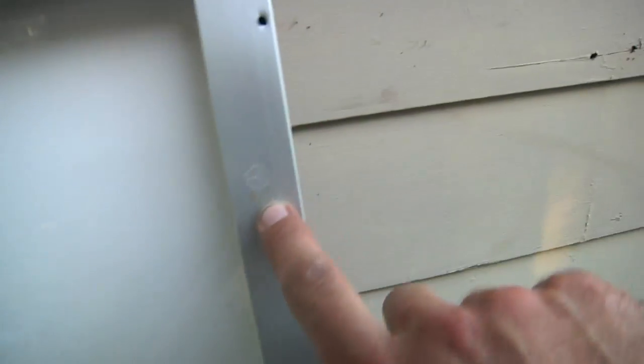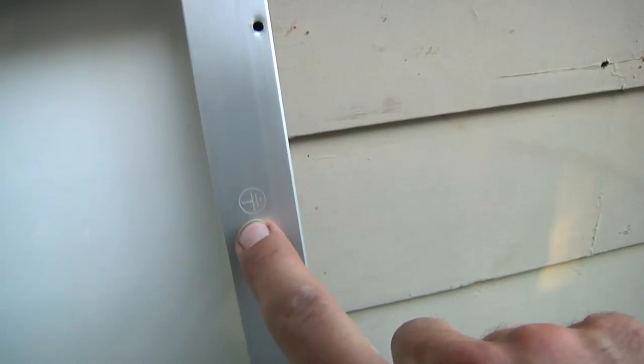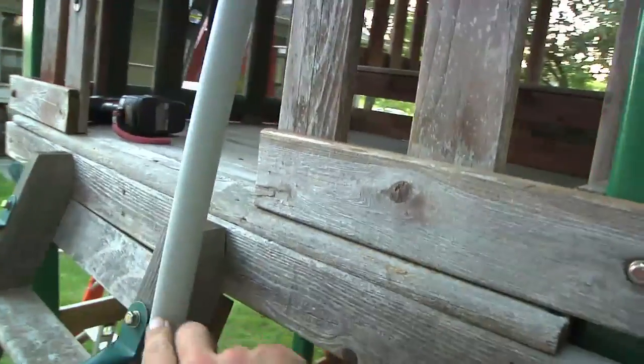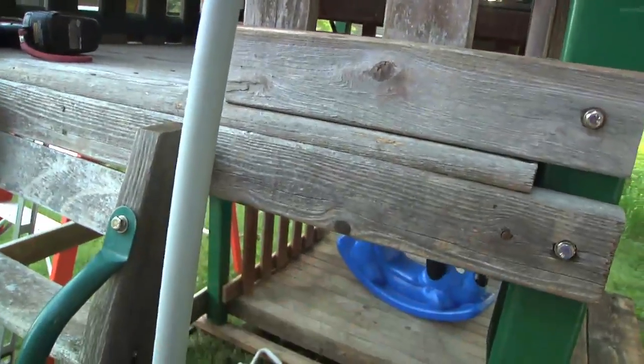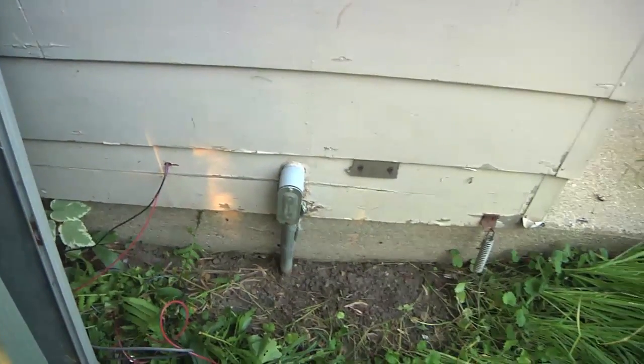You can see here's the ground to the garage panel. I think if I run either a bare copper or green color-coded wire and connect it to that, then the other end to the frame of the solar panel, I'm covered on the ground as well. I've got some 14-gauge wire, and this panel's maximum amperage is 8.27 amps, so 14-gauge should be plenty. I'm thinking I'll put a red, a black, and a green 14-gauge wire through the tube.